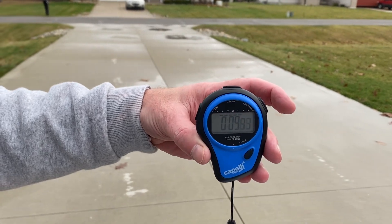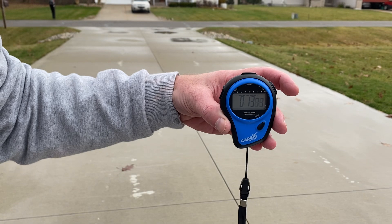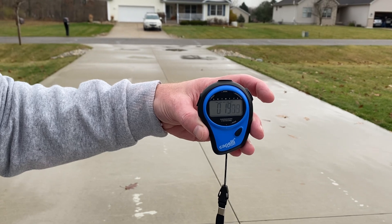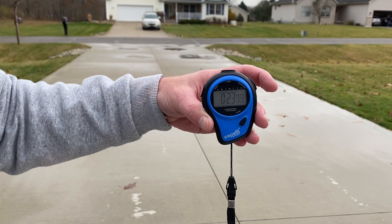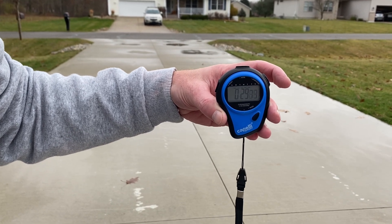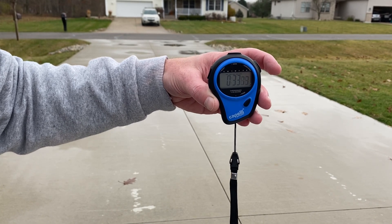Again, there's no nozzle — it's just a hundred feet of 3/4-inch inside diameter garden hose. We're coming up on the 22-second mark. Harbor Freight rates these pumps at 35 gallons a minute, but they're not sucking through a proportioner and we are. We just passed the half-minute mark.